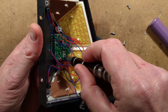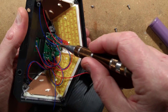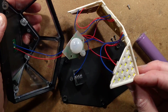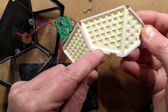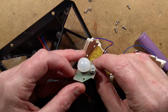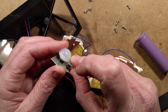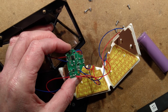Let's get the circuit board out. I can see a screw there holding a clear piece. Let's get these two tiny screws out — I'll note that for reassembly. This is one solid plastic moulding; that'll be why they moulded it in such a direction so it can come out of the mould with the pins sticking up. Here is the circuit board. We've got the passive infrared detector. As for the light sensor — they're using the solar panel for that. Here's the little silicon thing. It doesn't feel waterproof at all; water is just going to get in and it's going to die.